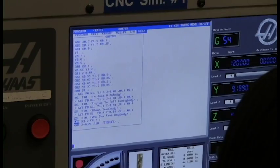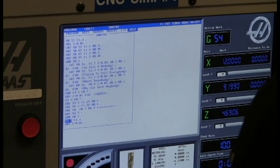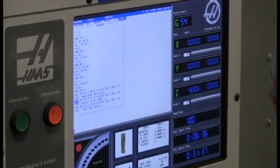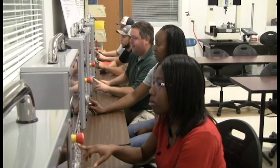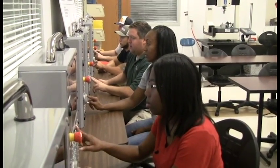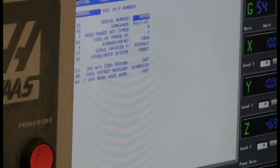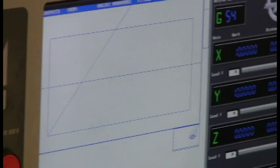I showed her artwork where she drew it out on a pad, and then she had to figure out where all these corners were. Then she had to write the program with all the G codes and M codes — G01, G1 — all the G codes to move it around the plate. Then we took it over to a simulator and she's got to put all that data in. The main thing is she's got to be accurate. Everything's got to be right. The numbers have got to all add up or the machine gets into trouble, goes where you don't want it to go.